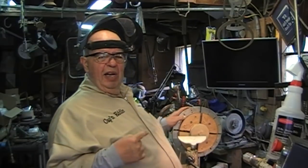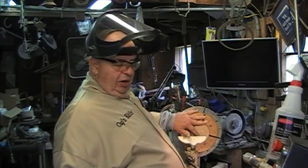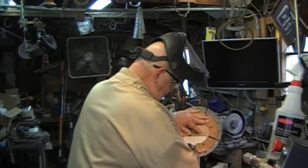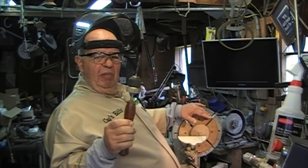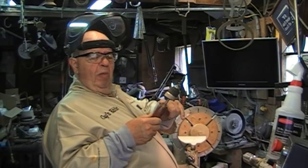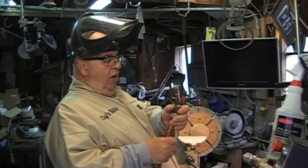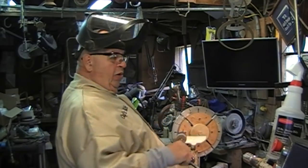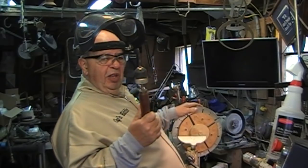As we get into creating this 2 1/2 inch penetration, I have to go through the center. You can do it a couple of ways. You can take a regular chuck and put it on a piece of 3/8 inch 24 bar and stick it in the handle, and then you put that keyless chuck on it. That works really good for going through the center of something, marking the depth of drilling while you hold it. That's a nifty little tool.